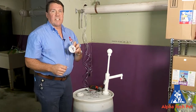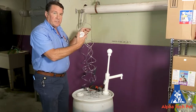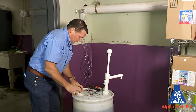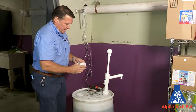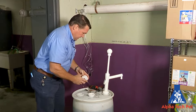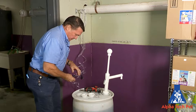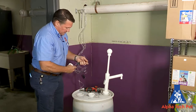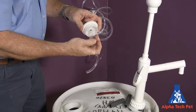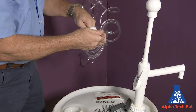Now that we have the mixing station installed on the wall, we're going to run the feed tubes. These are the suction tubes that are going to draw the chemicals up into the mixing station and mix it to the proper dilution rate. What I like to do is take the cap off, drill some holes in advance with our little drill. Then, to keep anything from falling into the larger hole, we're going to take the weight off and feed the tubes through — one for the mop bucket and one for the spray bottle.